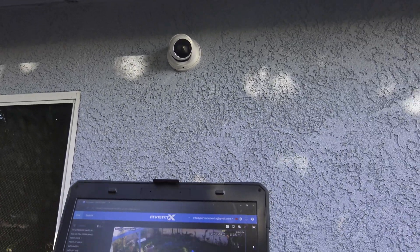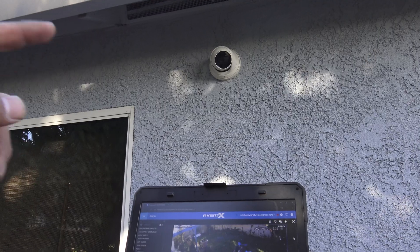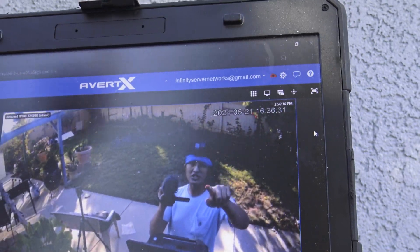Now we go to AvertX — let's add this camera. I'm blurring this out because I manage a lot of camera systems, that's what my company is about, so I can't show any of this. We're in this DVR now. We're gonna go to Settings, click Add Camera, Discover Devices — let's see if it pops up. It looks like we got the camera added to the network. Sorry for the loud barking — my neighbors neglect their dog. We got it added to the DVR, it's displaying an image, it's ready to go. This one is very clean and I'm really happy with that. That's all everyone, thank you for watching, I'll see you on the next one.